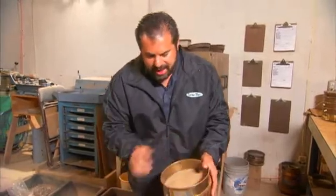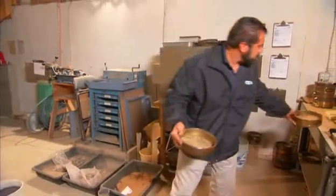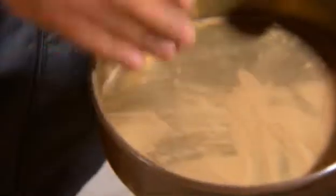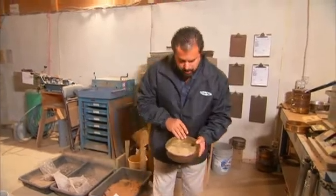You can see the material I have left in the 200 sieve, but what I'm really looking at is the material passing the 200 sieve — the material left in my pan. I'm less than 35% by volume, so I'm fine for material behind my retaining wall.